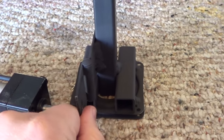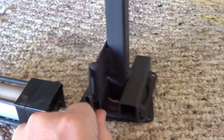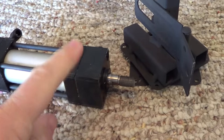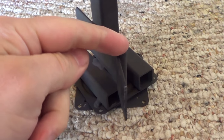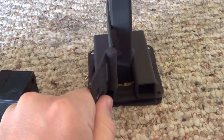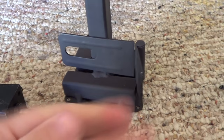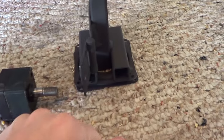When the cylinder spins, it'll allow the shoulders to turn 90 degrees. They'll have to have a pivot back here, because as this thing turns, it's going to want to follow the arc, and the cylinder itself will move back and forth. I laid this up in AutoCAD to get the measurements right because this is a 2-inch stroke, to see where the distance of the pivot point needed to be. When extended the 2 inches, I got a true 90-degree turn.